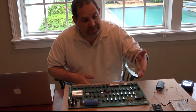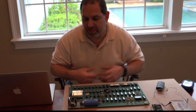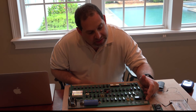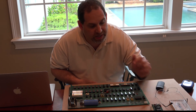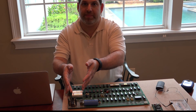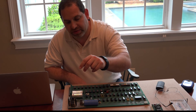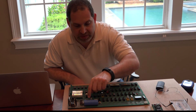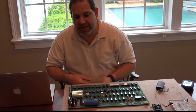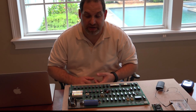This seems to be pretty unique. There is some damage from corrosion on parts of this board that can be corrected, though it looks like we're going to lose this transistor, which can be replaced, and the video pot. We did some electrical checking and noticed that one cap is a problem, we also have two diodes that are not working correctly electronically, and one diode here may also be a problem. There is some corrosion on this regulator, so we'll probably want to take it out, check it, and put it back if it's functional — if not, find a replacement.